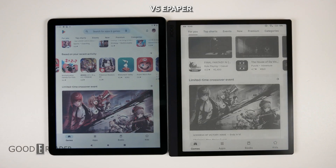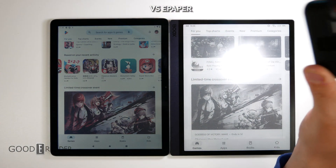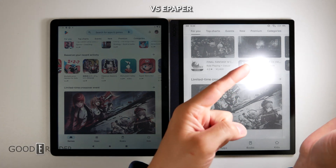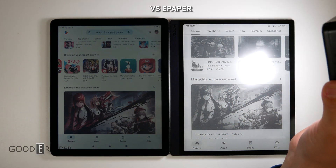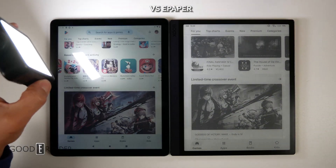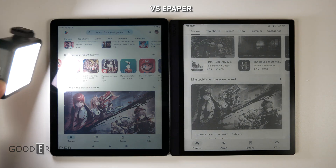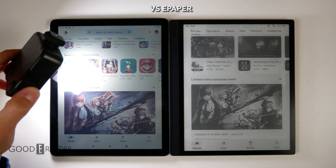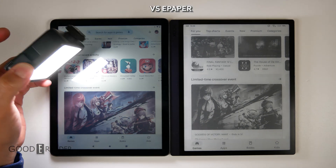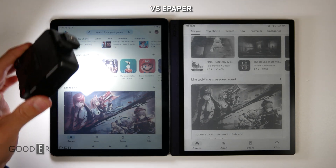Final test before we get into another unit is our light. When you have light on an e-paper screen, it doesn't really destroy the image too much — it gives it an overall paper-like experience. The actual reflection isn't a sharp reflection; it's more of a diffused interpretation. Whereas on the RLCD, you're seeing the actual light source reflected. But the colors look way better when you overexpose it and actually add an extreme amount of light to the situation — you put more potential to the reflective layer, thus giving it a boost, and it looks fantastic.